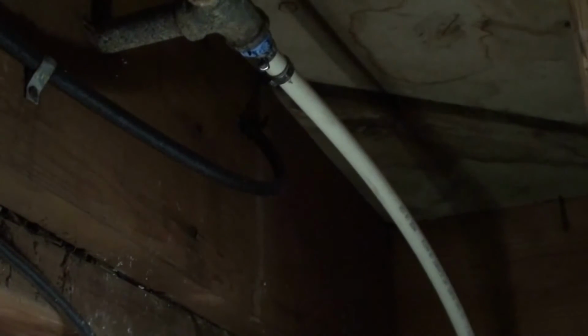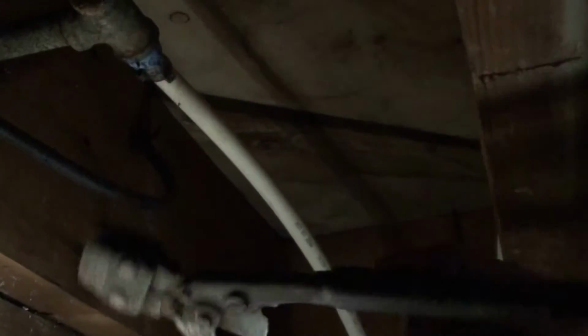Okay, so there's one. And I'm going to take my channel locks and twist that a little bit so that I can potentially get the other one on. Yeah, it didn't go a whole lot, but it should have moved enough for me to do what I need to do. Sometimes I'll get my tool on, then I'll bring it to the fitting. And right now I'm using that 2x4 to help me crimp it. Okay, and then that's it.